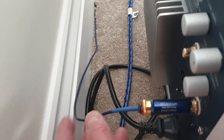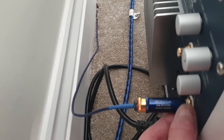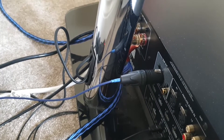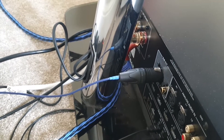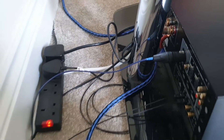I've actually hacked this a little bit because I've connected this RCA input to an XLR output on the amplifier, and I haven't shorted the earth pin across, so it's actually getting four volts rather than two volts. So there's four volts going into this, which might help switch it on a little bit earlier when there are some low-frequency transients.